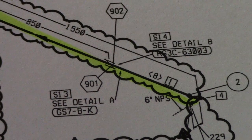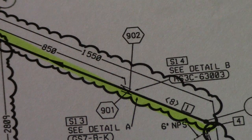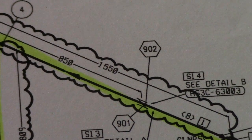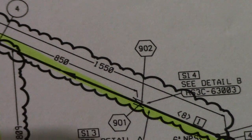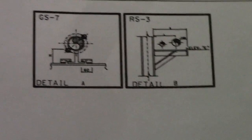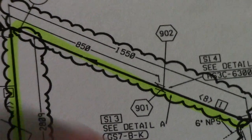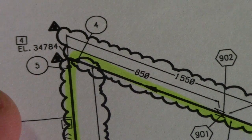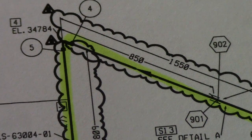This is a support — Support C, Detail B. This arrow here is the flow direction. It means this pipeline is going to North, because our North symbol is here and the line is going to North. Also, see this C detail elevation, and then the line goes down.